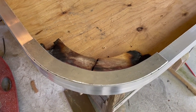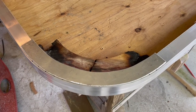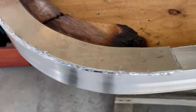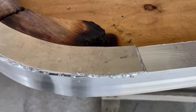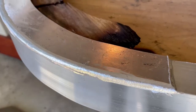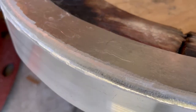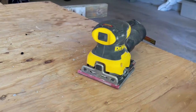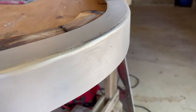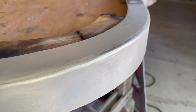I don't want to make this video about brazing - there are some great videos already out there you can check out. Here's that piece attached; it's still really rough, so time to clean it up with an angle grinder. Cleaned up nice. After grinding it's still a little rough, so we move on to the sander. After a little sanding, that's our finished edge - just a little rounded off. Pretty happy with that profile.